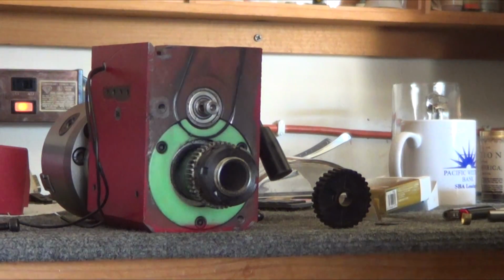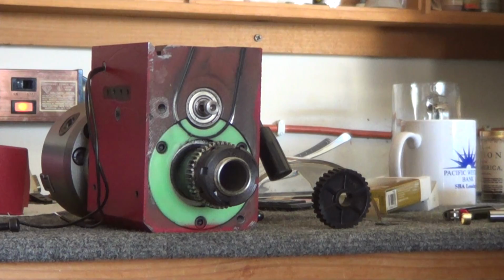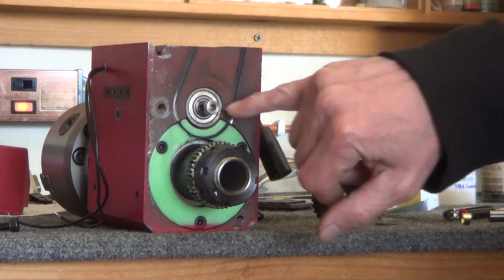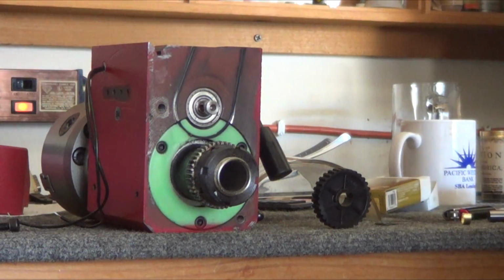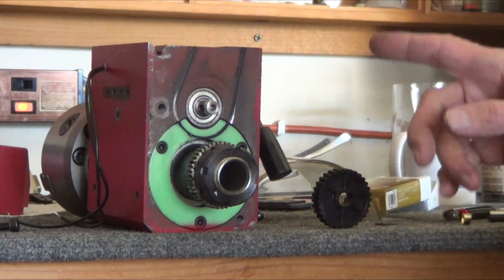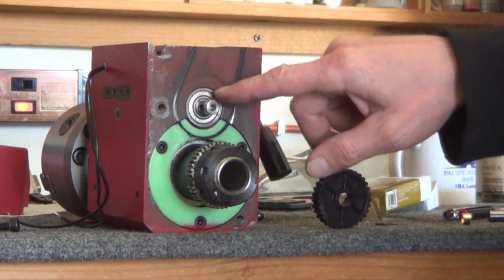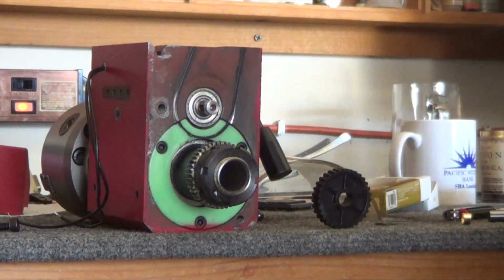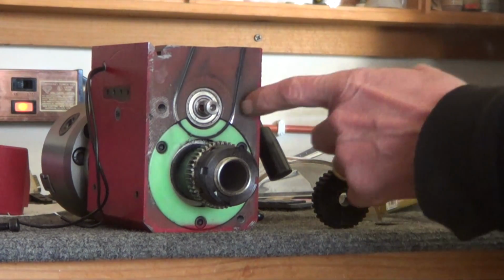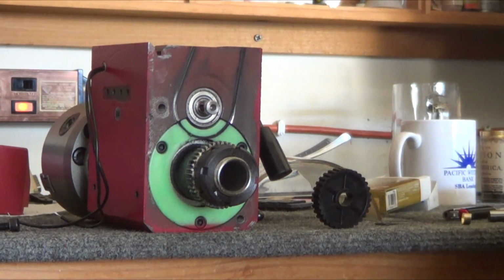Yeah, I just forgot to mention that if I push and pull on the shaft, I've got movement, and I can see it in the bearing. So the bearings are bad or sloppy, but I'm not going to bother replacing them. And just so you guys know, all you have to do is read the number that's stamped on it, type it into Amazon, and bingo, there it comes up. Bearing 28mm by blah blah blah. And this particular bearing, you can get 5 of them for $6, and it's Prime free shipping.